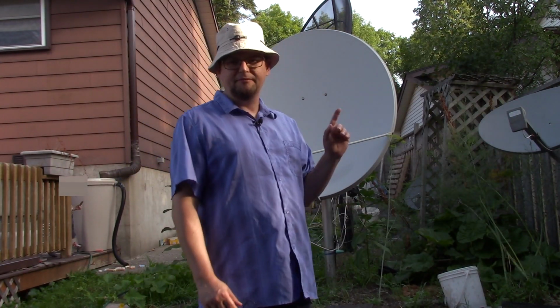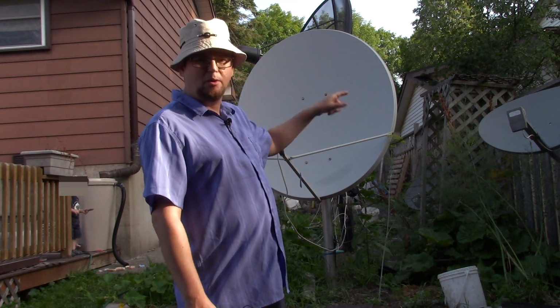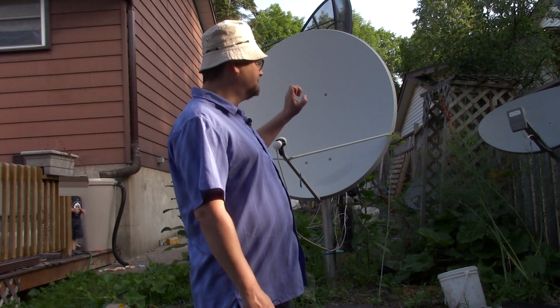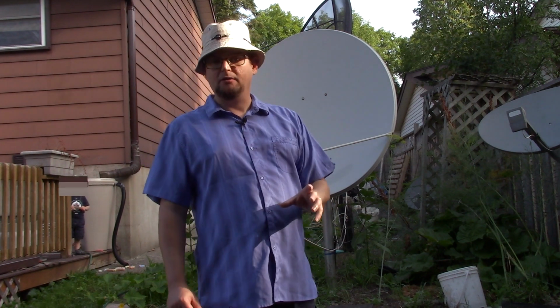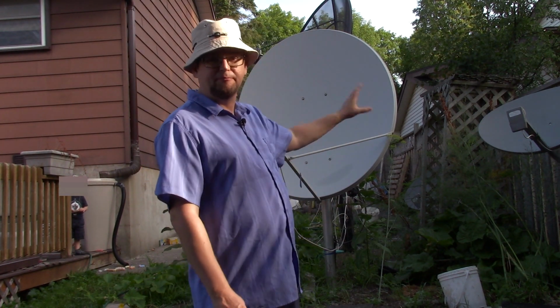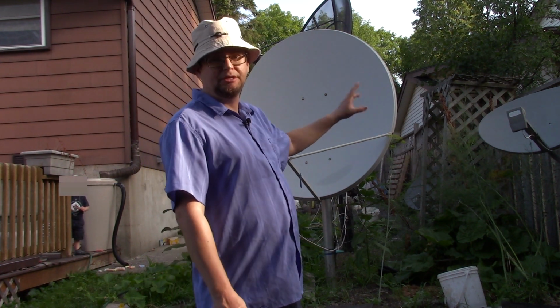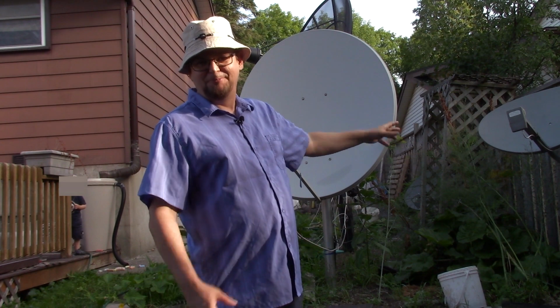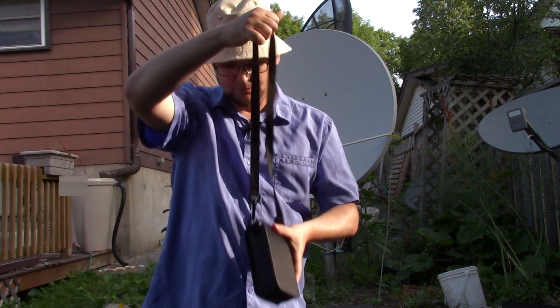One thing I've emphasized in a lot of my videos is that a Shaw Direct dish like this will work for free satellite TV. It's not as big as my 36-inch dish, so it's not going to get the signal as well and might not get all the transponders, but I've been using one of these dishes for Galaxy 19, 97 West for years. I've done videos where I put it on a fence pole, the wood cures, so I have to come back out and move it all the time.